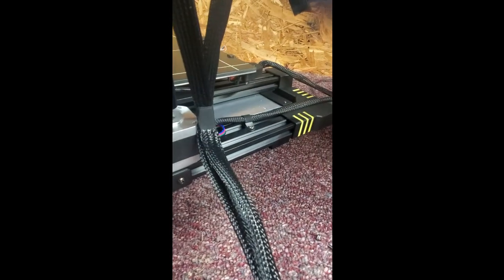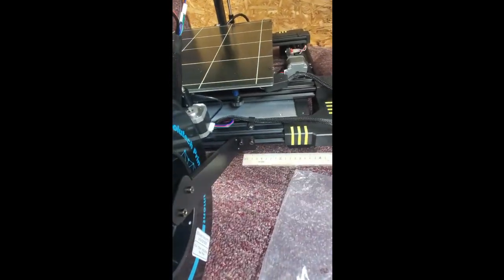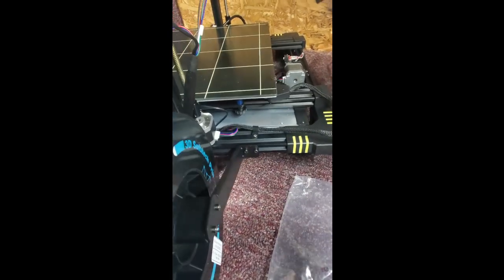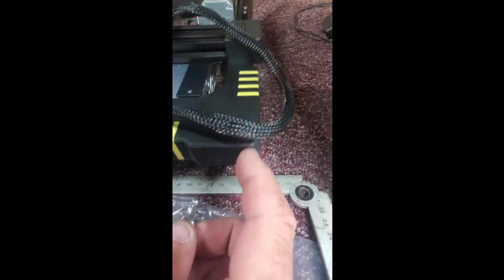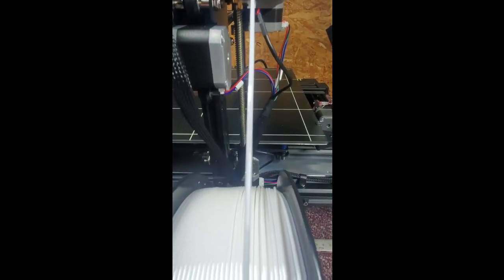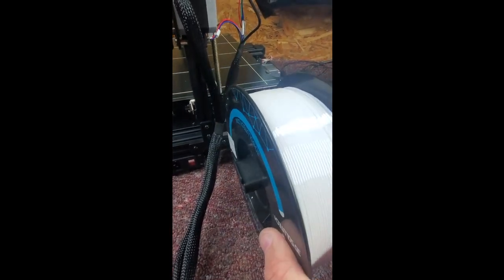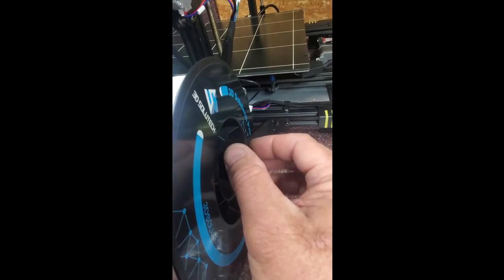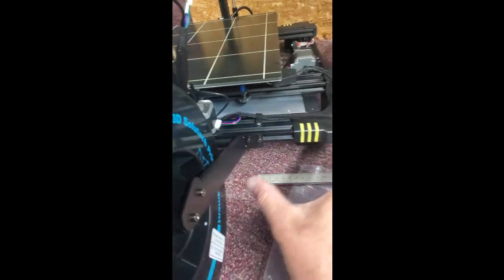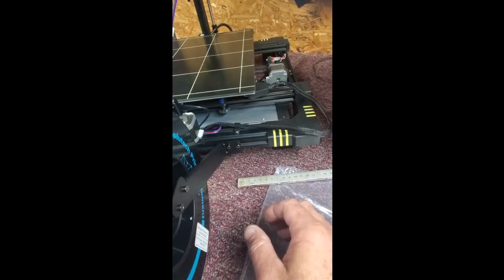It's going to go right back here somewhere. For the spooler mount, it says 140 millimeters. I did about six and a quarter inches — about 160 millimeters from the very corner of the seam here — to bring it over and line it up in about the middle of my spool. The only drawback is a couple of things I don't like: there's a lot of play on this spool holder, so that's something that'll end up being changed — probably an upgrade I'll have to do. And the picture in the manual showing where to put this was not that great. You really need to be able to zoom in.